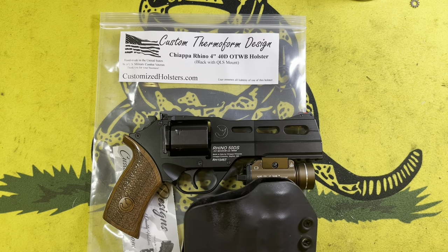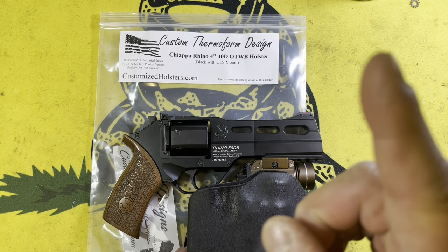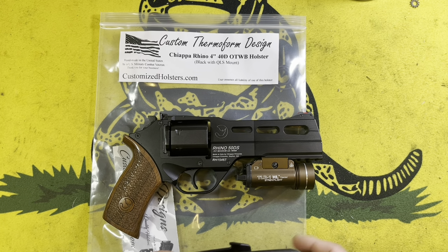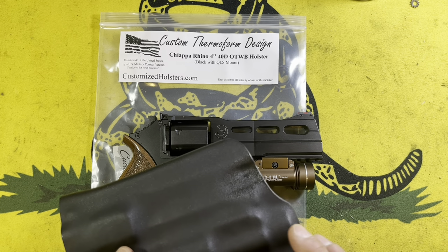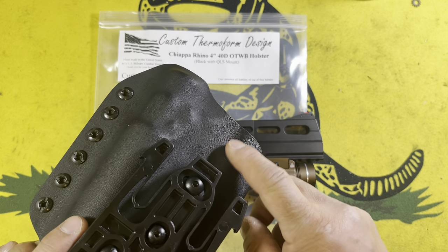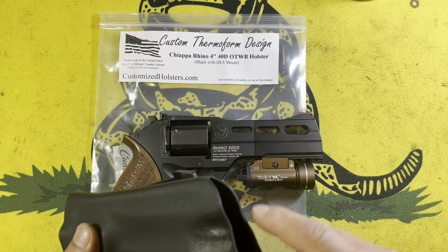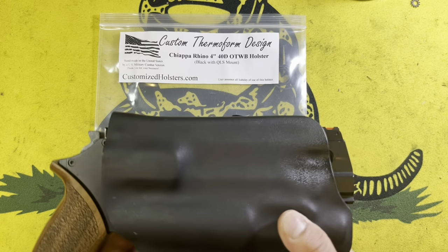I took a heat gun and watched a couple of YouTube tutorials — I'll put links to them in the cards up in this general area right here. It showed that you could use a heat gun to slowly heat and reform your Kydex, and that's what I ended up doing. I did make a mistake and leave the heat gun on here too long. You see how it's shiny right here — this is what happens when you burn the Kydex. You just heat it a little bit too rapidly and it actually gets this glossy finish. So that's a mistake here for me. But I was able to go ahead and get the bottom opened up here.